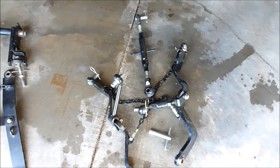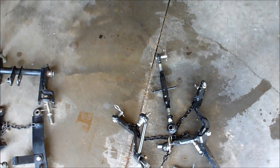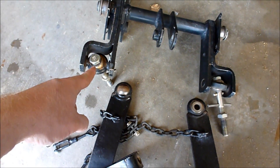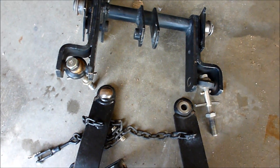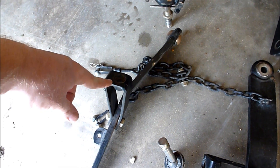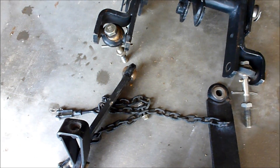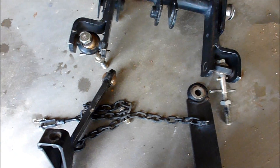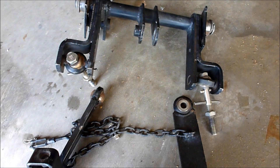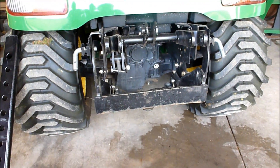It takes me less than probably three minutes to put this hitch on this tractor. I can't video it because I don't have somebody to hold the camera, but I'll time it — I'll put it on and take the quick click-and-go off and time it. Now, the Category 0 is not a quick attach. It's like the old-style 318 hitches, where to adjust the draft links or the three-point arms, it's just a screw. So to take the hitch off, you have to completely unscrew that screw, and you have to hope you never bugger up the ends. The Category 1 Limited is just a complete quick attach.